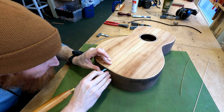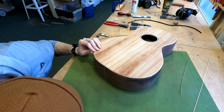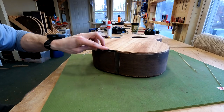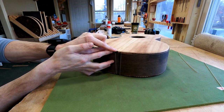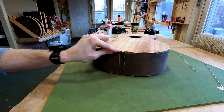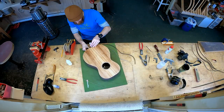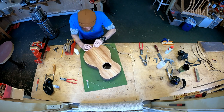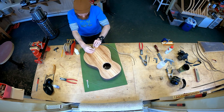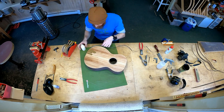When you're dealing with very thin elements like this, you can just eyeball that angle. Now I take that same chisel and just nip a corresponding angle into the purfling coming up off of the side of the end wedge. Before we glue this, we want to check and make sure that angle looks good, because we can always take another little nip off to adjust it slightly. It looks good, so now I'm going to glue the binding and the purfling strip all at once using Titebond Original, running the glue out a little bit at a time, and using good strong binding tape such as the stuff from StewMac.